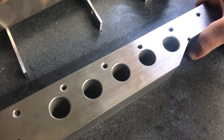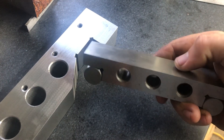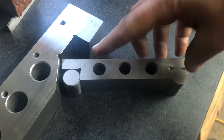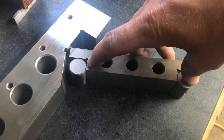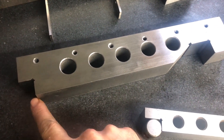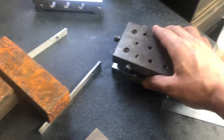Sine bars — I typically use this style. There's a five-inch one right here, and I like it because it's flat on top. That's about it. I can tell you it's about six tenths short. The problem with this style is you can't take these pins out. If you want to make it longer, you grind this end down. If you want to make it shorter, you grind this end down. That's that. I use this a lot — that's my go-to sine bar.